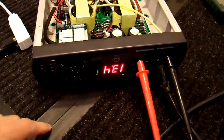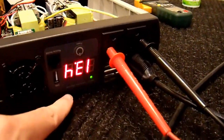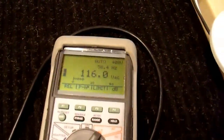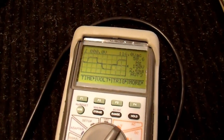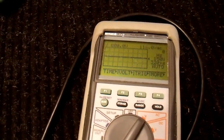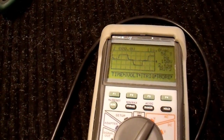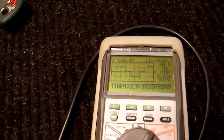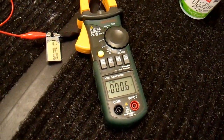It is working. 13.4 volts, zero watts — which is good because there is no load. I have 116 volts output. Checking the waveform, it's a modified square wave, modified sine wave, just like you'd expect. This meter doesn't always trigger on those perfectly, so it's not the inverter's fault that it's jumping around. And about 60 hertz — all's good there. It's drawing 0.6 amps, exactly what it's rated to draw under no load.